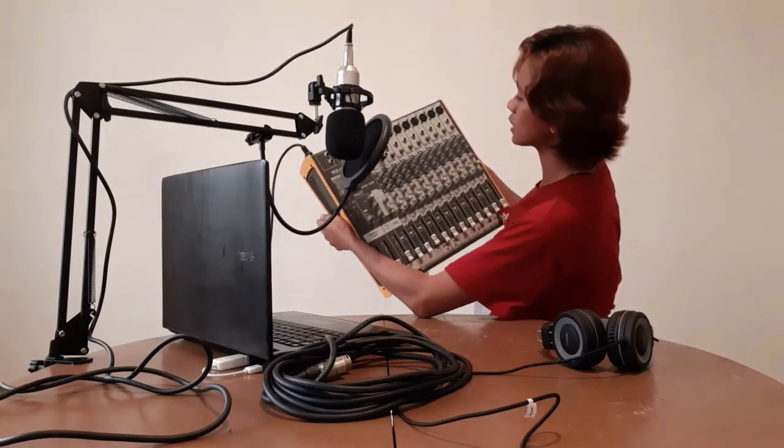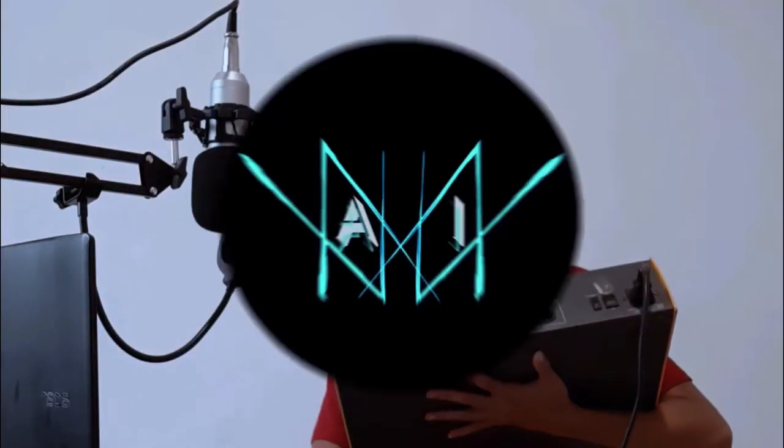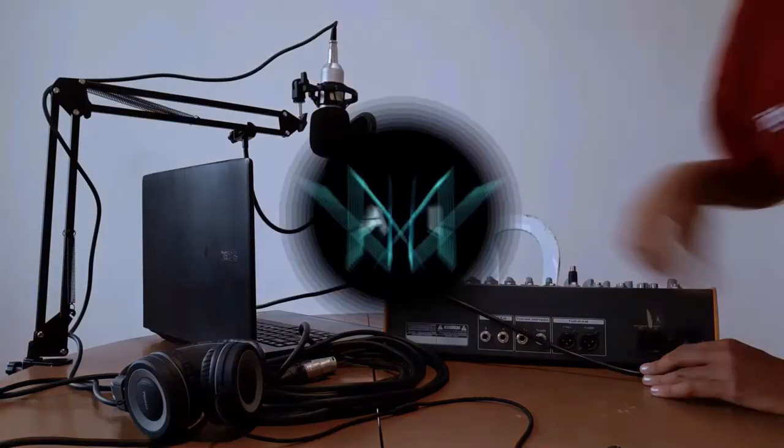Yes, we're back again and you can see that our XTuga BM800 condenser microphone is already set up. You can also see that our laptop is here because I'll teach you how to record using our laptop and using phantom power. Sad to say, I don't have a phantom power unit, but the good news is I have a channel mixer with built-in phantom power. So you can see this is our channel mixer. I'll just show you where the phantom switch is. This is the phantom, so I'll just switch it on.